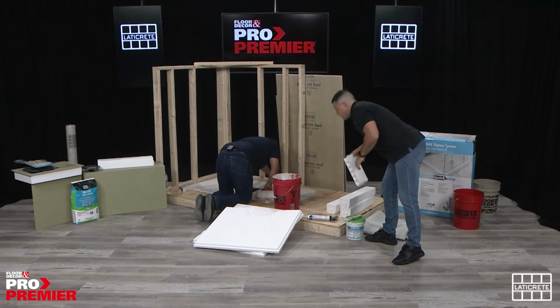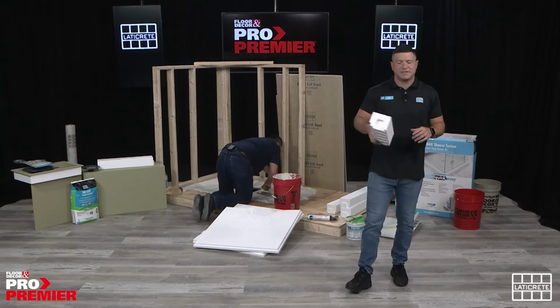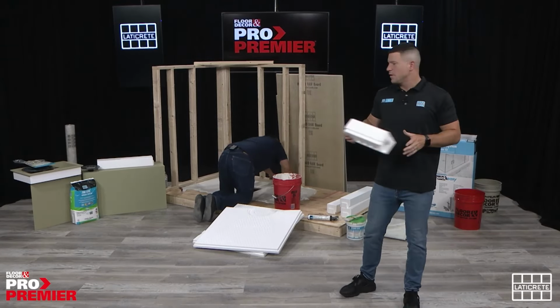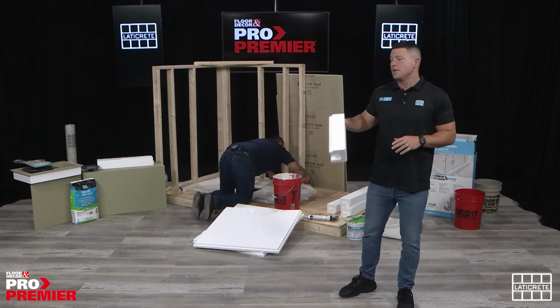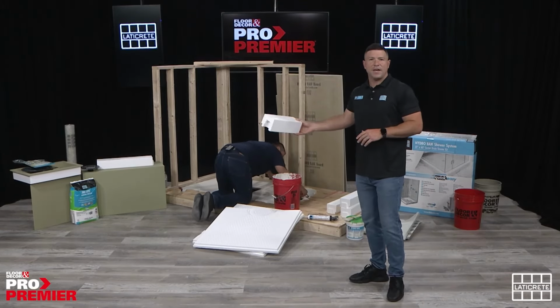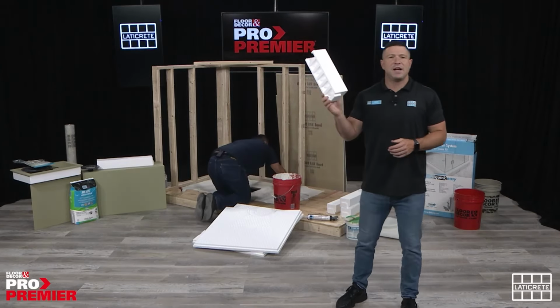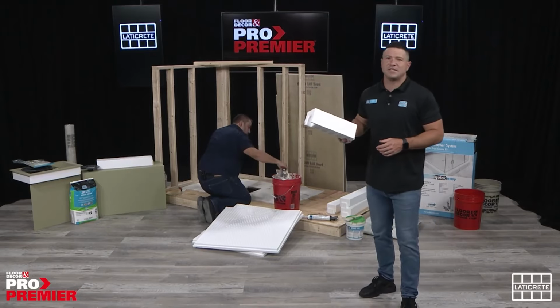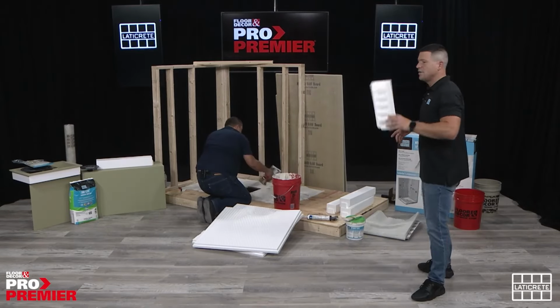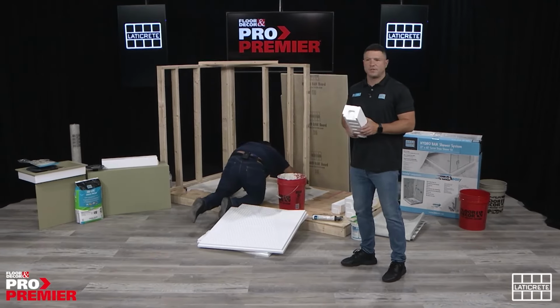And then for each of our kits, it comes with a corresponding curb that comes along with it. The one I have in my hand is a modified 24-inch curb because it comes in 24-inch increments. So for the sake of this specific pan, we're looking at 60 on the long end. So you'd have two 24s plus a third that you'd have to cut in half to make up for that 60 dimension. So we took the liberty of cutting that beforehand, so we were just ready to go for this installation.